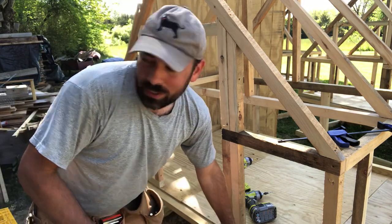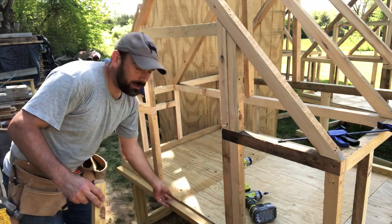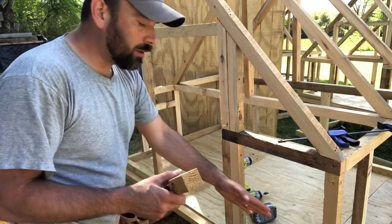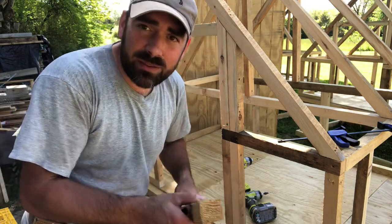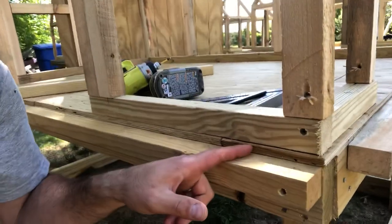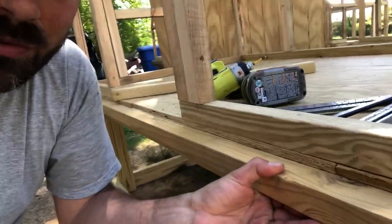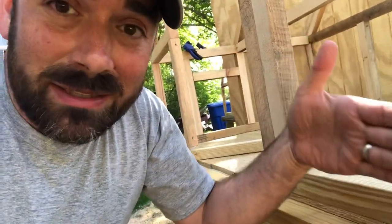Here's a helper thing. What I did was add a board down here — just a scrap piece of wood as long as the side is. I screwed this in just underneath the plywood layer. So we've got the plywood layer and then we've got this screwed in, and what this does is it creates a lip for the sheeting to stand on.